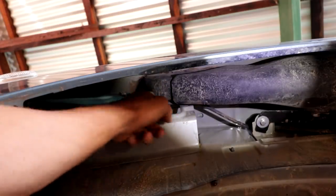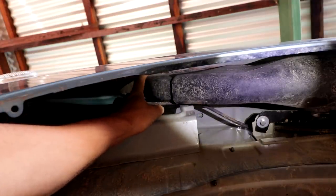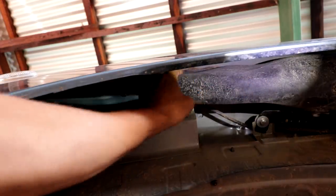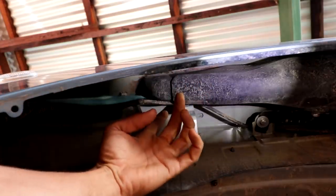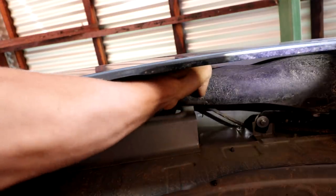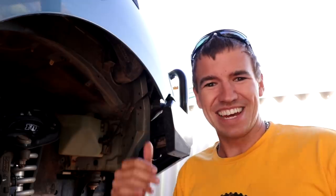This pipe here goes to the outside of the car to the ram head, and this bit goes down to the air box — two separate pieces. Since there's a join, you can stick your finger in there, and when you turn the car on you can actually hear the sucking. If you got stuck in a bog hole and were stationary, you could have water rushing in here — pretty much bye-bye engine.